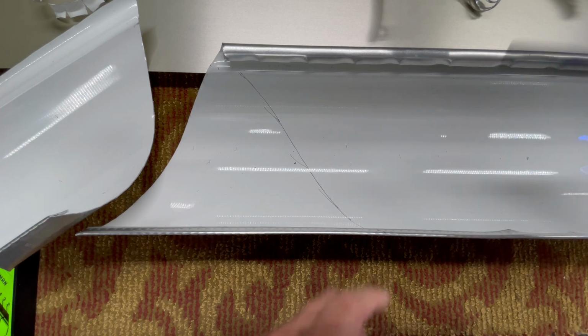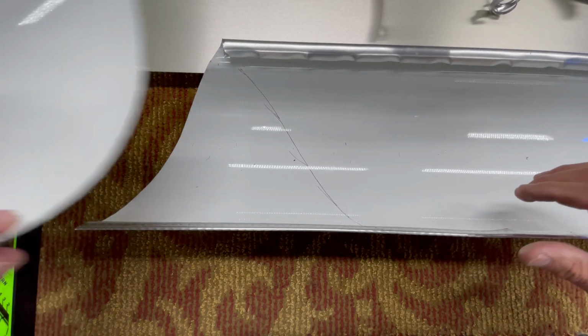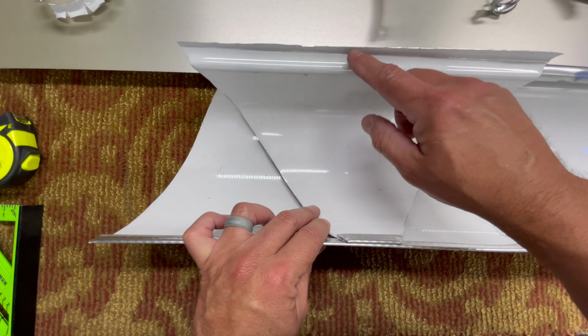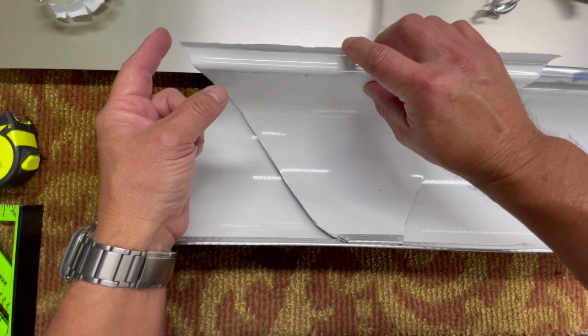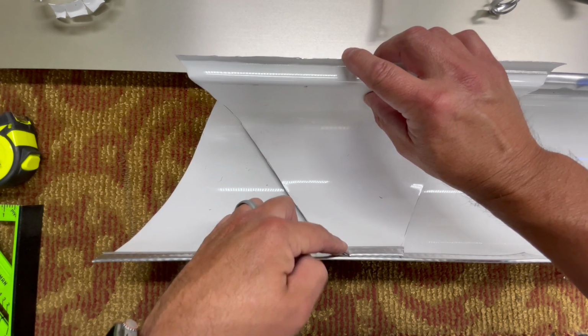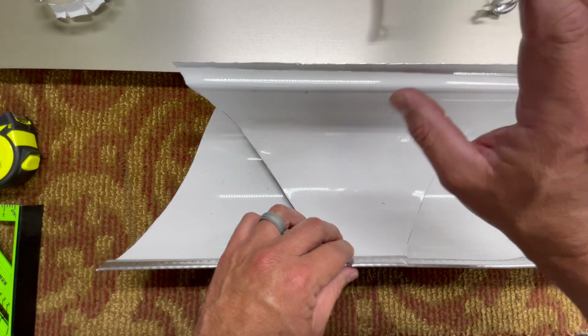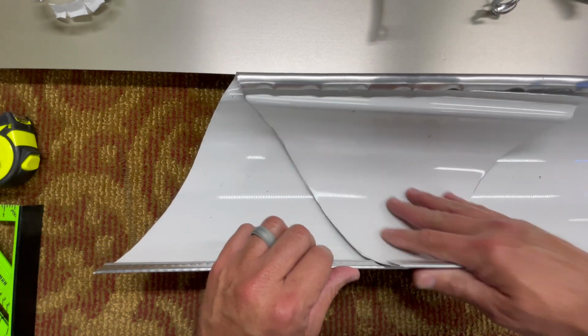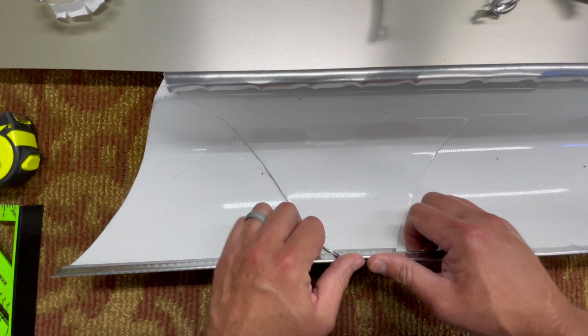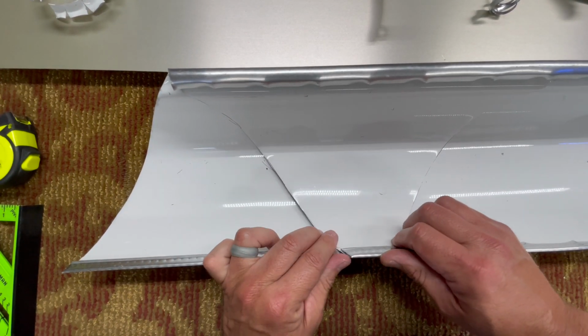If you want to do a bay miter, then you would just cut this measurement in half. Instead of doing it from center, or from this line to that line to this line, 6 inches, you would cut it back to 3 inches, and then still go to this line here, and that would be your outside bay. Now, some bay miters vary. They're not all 22.5 degrees, so just be careful with that. But anyways, that's how you do it. That's how we do it.